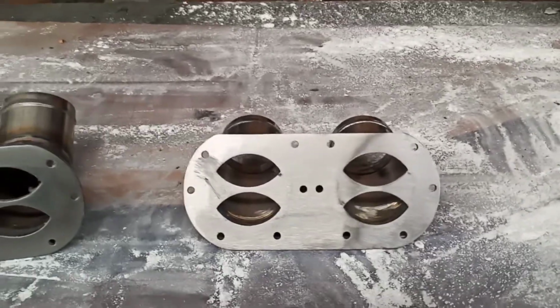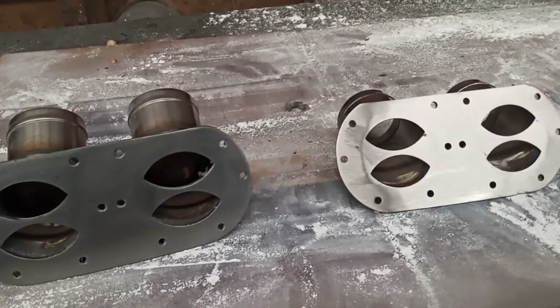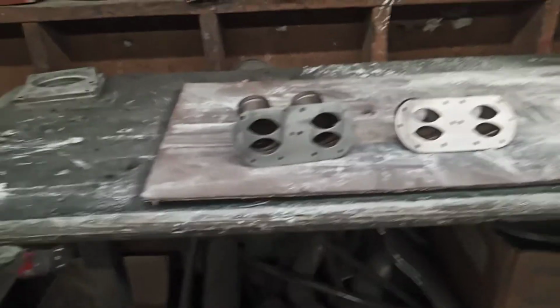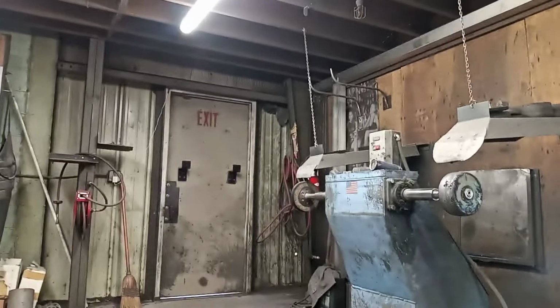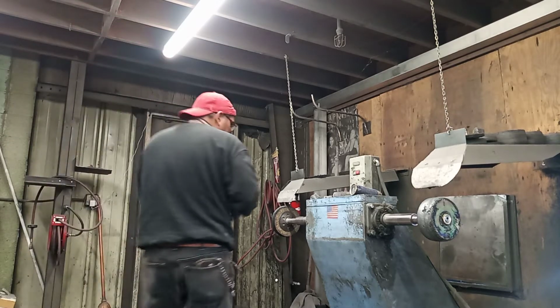So this is greased right here. This is belt sanded. What we want to do, we want to polish it out. Right now we're going to sisal it. Remember, we went from belt sanding to we're going to grease it, sisal it, and buff it. Right now we're gonna go ahead and sisal that piece right there really quick to show you how to do that real fast. Stainless steel is like, man, I swear it's like the hardest metal to polish, because it's so strong.